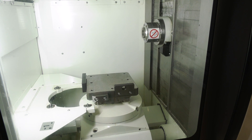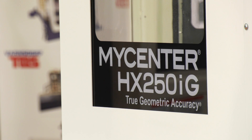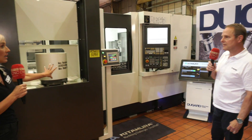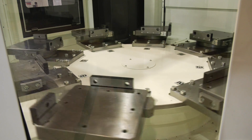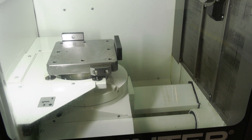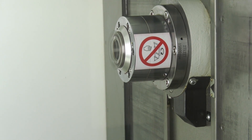Let's look at the name: HX 250 — the 250 denotes a 250mm pallet size, like this one here. All machines are standard with 250 pallets and a 100 kilogram loading capacity on the pallet. The 'I' relates to the internal drive for the fourth axis, which is incredibly fast at 300 rpm. The 'G' denotes the latest generation of Kitamura.